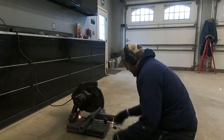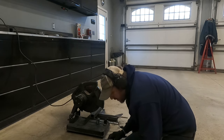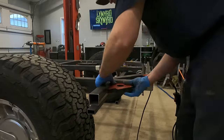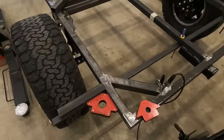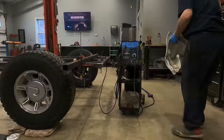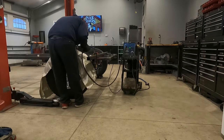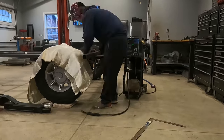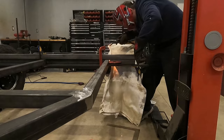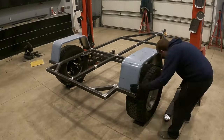The first part of mounting the fenders is pretty easy — it involves four straight cuts of square tubing. I'm using this tubing as outriggers in the front and rear of the fender. I started by clamping a scrap piece of metal underneath the trailer frame to help hold the outrigger in place, then I used a magnet to make sure it was square. I also clamped another piece of scrap metal to make sure it was perfectly flat along with the frame. Once I was satisfied, I protected the tire from sparks and welded it in place. After tacking it in many places, I welded it solid, then moved to the front outrigger and did the same. Once the driver side was done, I moved to the passenger side and repeated the same process.